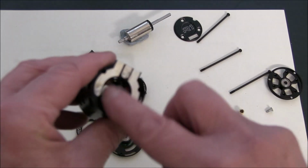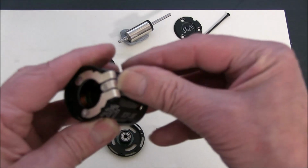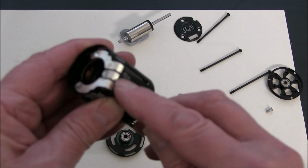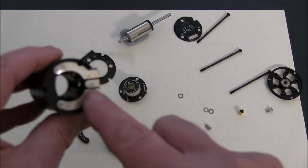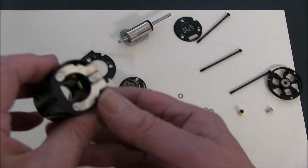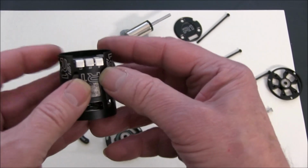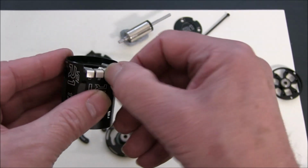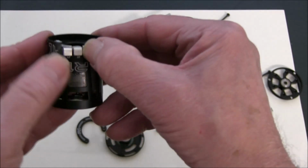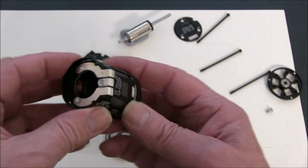Those are the three connections on the back. A very short one to this top middle connector. A lot of people, when they're badly soldering, heat this up and keep on heating and heating. They melt the solder off the connection to the wire there, which is always a problem on all motors. Also on the R1, they've still got very narrow gaps between the connections, and it's very easy to get solder in those gaps when you're not very good at soldering.